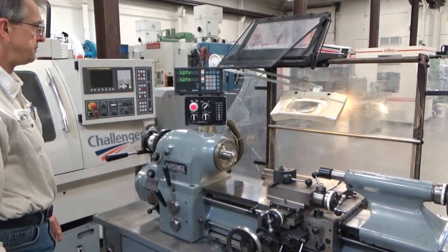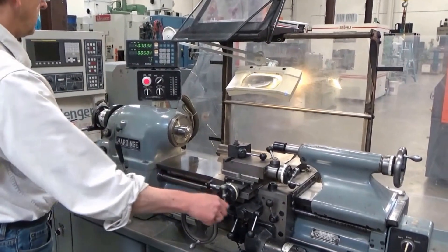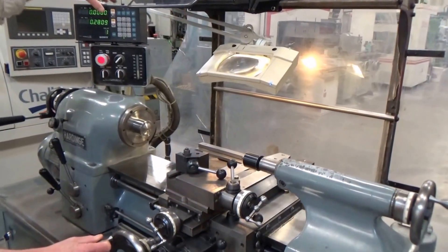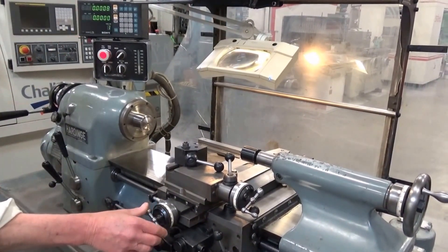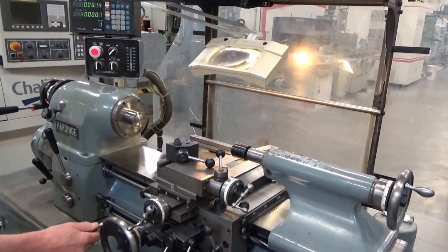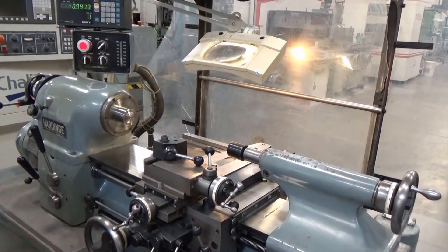Bring that up, and reset. We can dial — let me reset again, give them zero out — zero, zero. That's real nice there. I'm just barely moving, so four places after the decimal. Tenths is nice on this machine, so that all works.